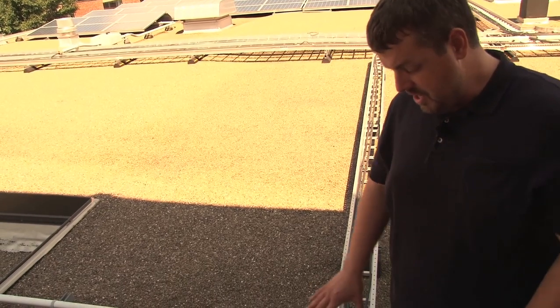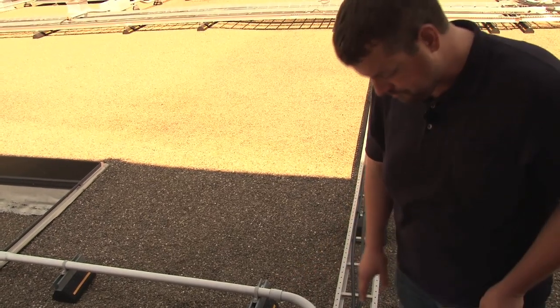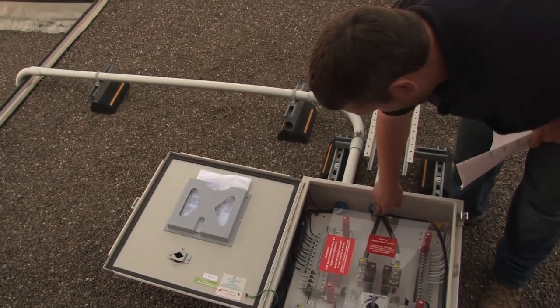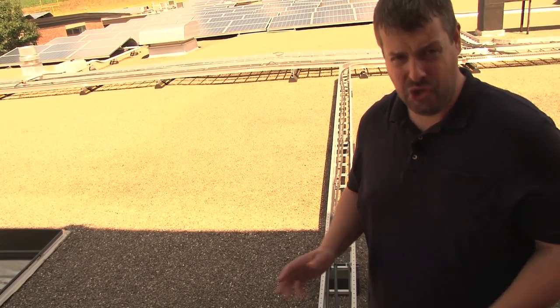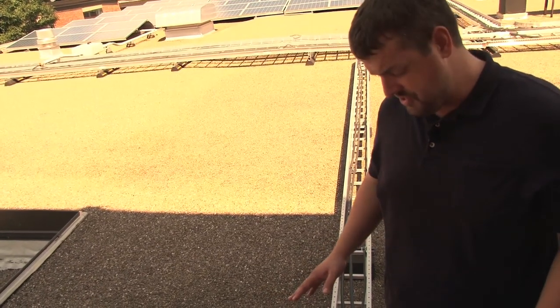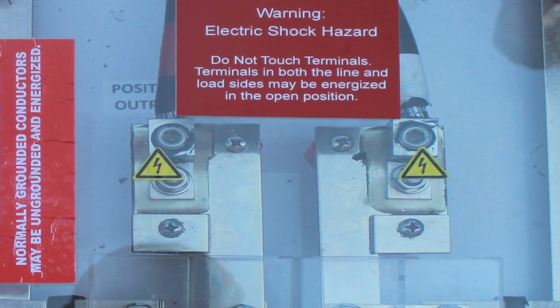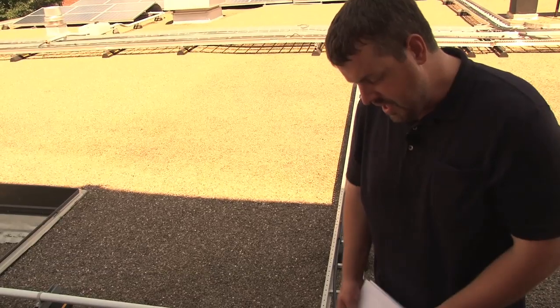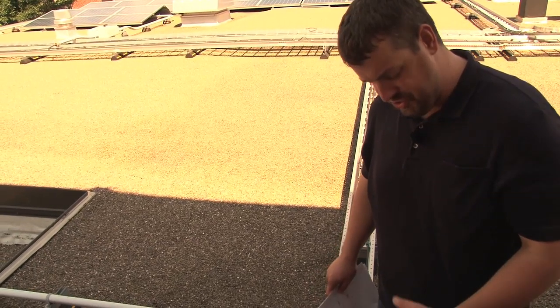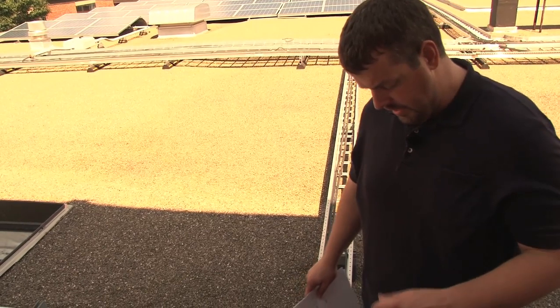Important to me as an inspector — this is a really critical piece of equipment. This is where you're bringing a lot of power together. Commonly, what can go wrong here is that either a source circuit conductor or the output circuit conductor can become pinched, chafed, or nicked in some way and start to short out. If you were going to have a fire or have some serious issues, this is generally where it happens. You want to pay close attention. Number one, look at the terminals — here we can see they used aluminum wire. With aluminum wire, you've got to protect that from oxidation. It's important that they use some type of antioxidant, and we can see they did that here. Additionally, you want to make sure you don't see any kind of burns or melted portions of bus on any of the connections.